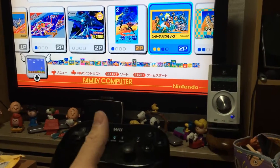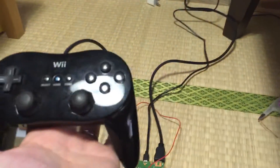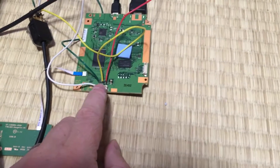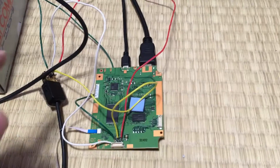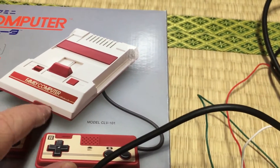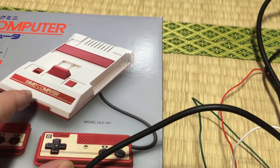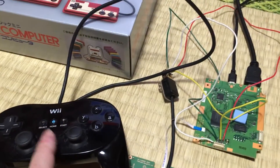So for those of you considering buying a Famicom Mini but worried about the controllers being too small, there is a way to solve your problem. Four wires — and the best thing is I've connected them behind the port so I can still use the original controllers as well. I'm thinking I might wire this Wii nunchuck port into the front under here, because this is the original controller expansion port, so I might do some creative dremeling and a bit of hot gluing to get it to fit in there so I can use both the original controllers and classic controllers on this.